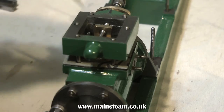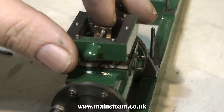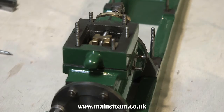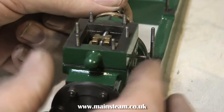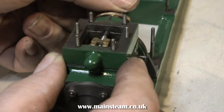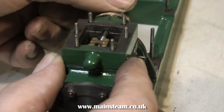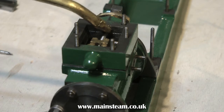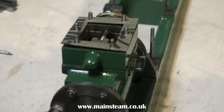Also, make sure that the little cross piece — the brass piece you can see — is not a tight fit in the actual valve. The valve has to float slightly so that steam pressure can hold it onto the face. It's quite a routine job this; I've done it many many times. The gland's been packed with some graphite yarn, and I'll just put a bit of oil on here. Then all that's left to do is to fit the gasket, followed by the steam chest cover.